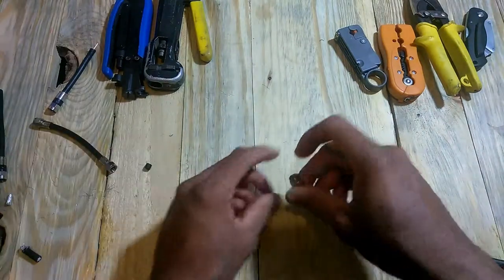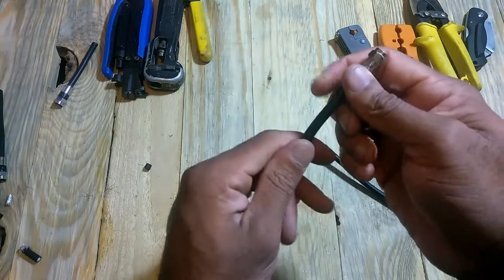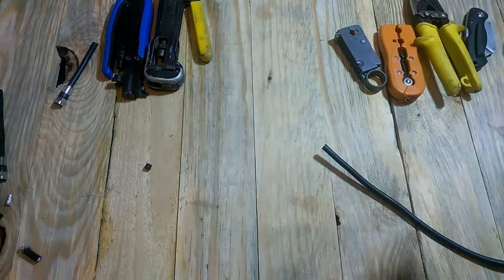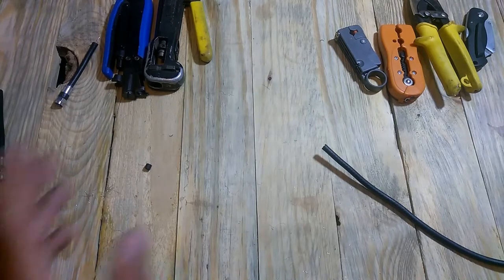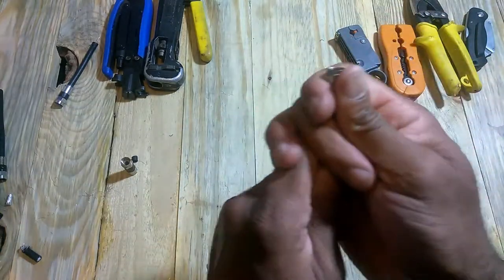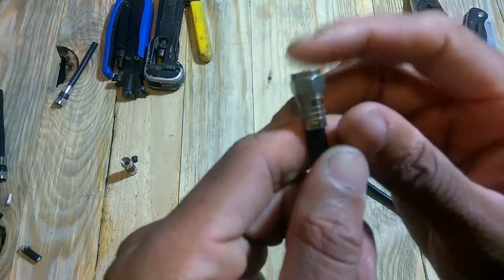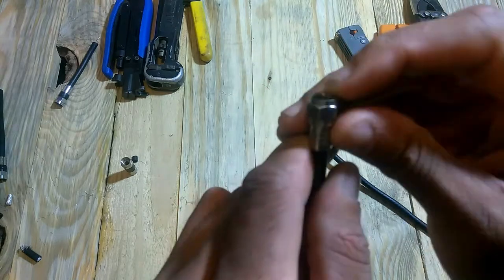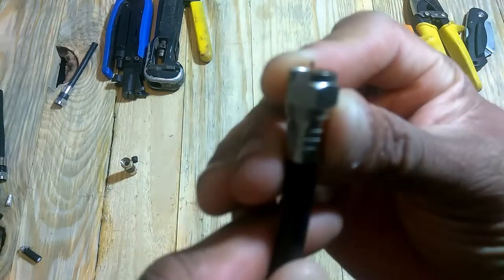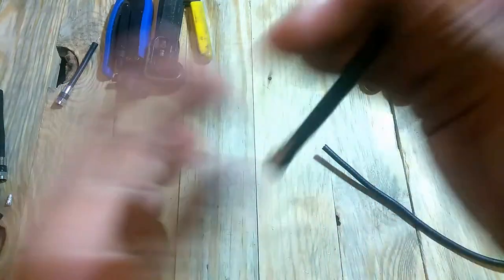So you want to get a compression fitting. Those screw-on connectors are good for short term, but I wouldn't recommend using them outside because they won't hold the cord. For example, with this crimp connection right here, I could just slowly pull on it and it's eventually going to come out, or the wire is going to be pulled so far back that the stinger in the middle is not going to be making the connection. I was able to pull that stinger back — you can see that copper thing sticking up. With these, you can pull it back and it's just going to lose connection.